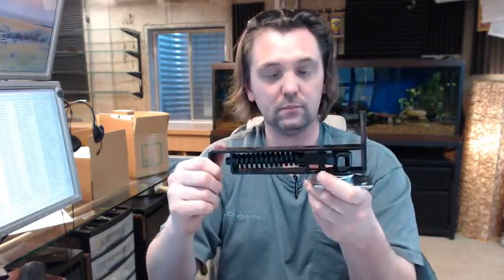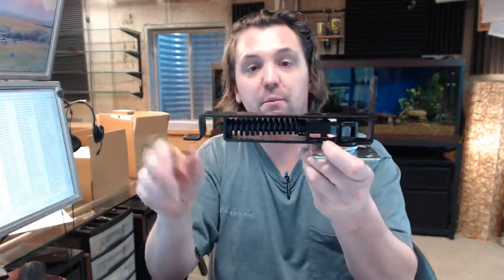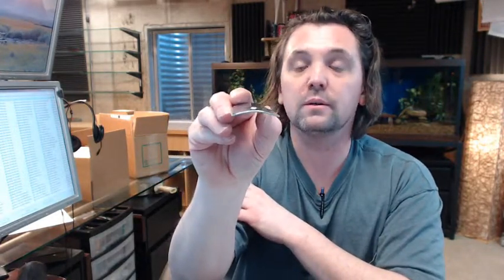After you've prepped the bottom of the door, this should fit into it. Okay, you should be able to get this to the bottom of the door, and everything should square up real nice. You can then attach that to the bottom of the door. That heel plate we talked about earlier, I didn't mention it, but it's curved. And it's curved because they are certainly assuming that you're going to radius the edge of the door.